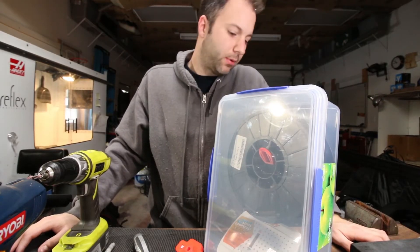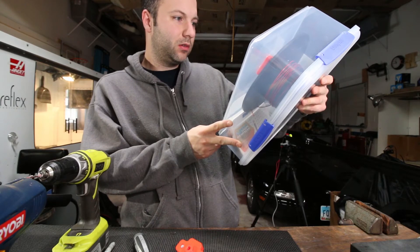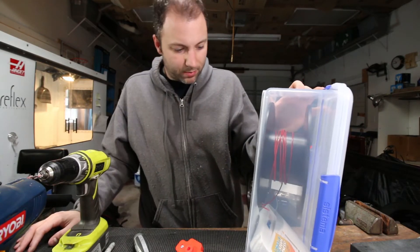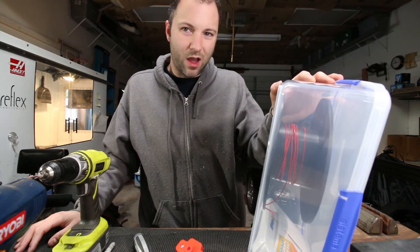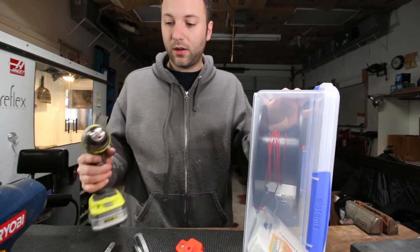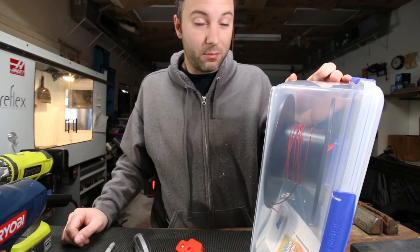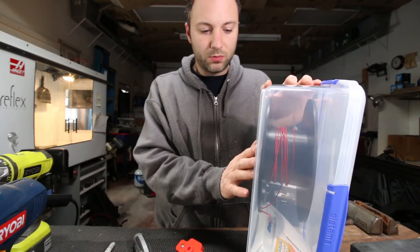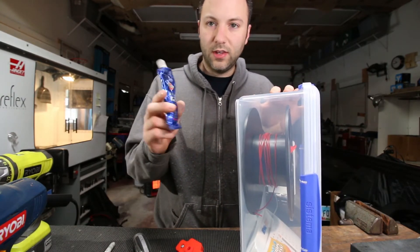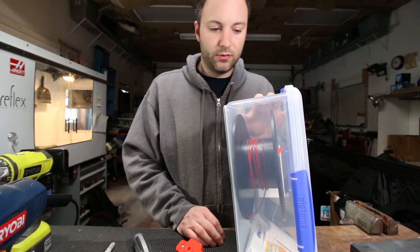Slight problem — apparently whatever this is made out of is a little brittle, and it cracked when I was drilling one of the holes. Maybe not the best choice in materials for this. How I was drilling it was not ideal. Plastic bits intended to drill into acrylic will be a lot better. Maybe even drilling in reverse sometimes can help so you don't crack plastic. What I'm going to do is make a little reinforcement panel out of aluminum, transfer that pattern over to it, apply a little RTV gasket maker along the whole backside, and that should seal it up and reinforce it.